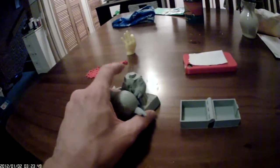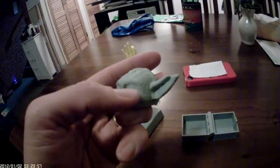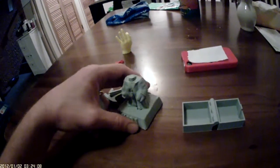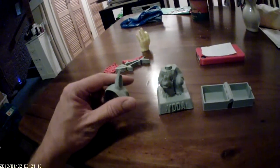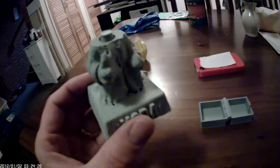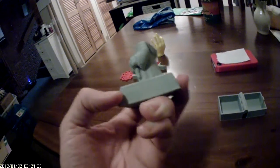And then I printed out this Yoda head. You can see some separation — actually I'd probably call it lack of fusion, just above the eye here. I increased the temperature and it came out good. It was printed out on the bed with supports on the ears. I was printing it a little bit too hot — about 245 degrees — because the supports actually gave way before they even got to the points they needed to support. You can see in the lower temps there started to be a little bit of cracking or separation, but up higher where the temperature change was, just at the top of the base, it looks really quite good.